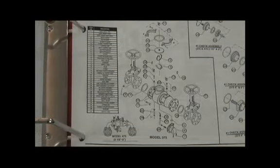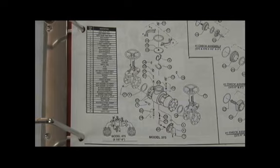The 375 check assembly, similar to the 350, horizontal body, single access cover from the top. Groove coupling holds the checks inside the body. The checks are modular. Both checks come out from the top. The check mechanisms, like the 350 series, also can be repaired without releasing the spring tension. Four bolts on the larger sizes remove the check disc holder, so you can change the check disc. There's a single bolt that holds it on the 2.5 and 3 inch.